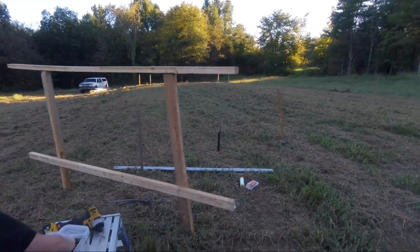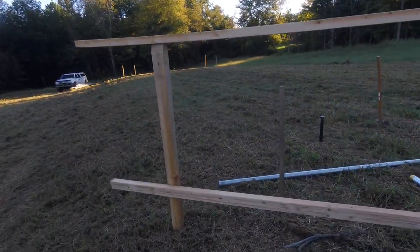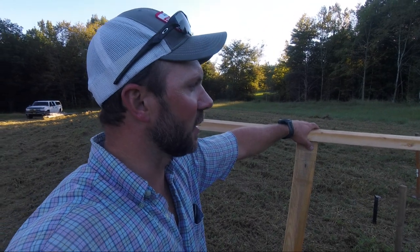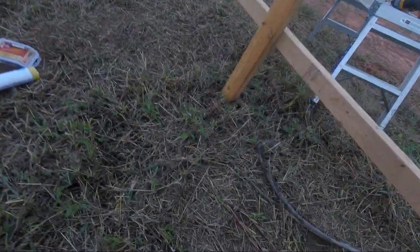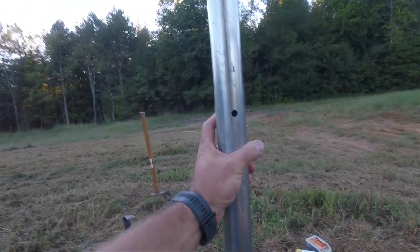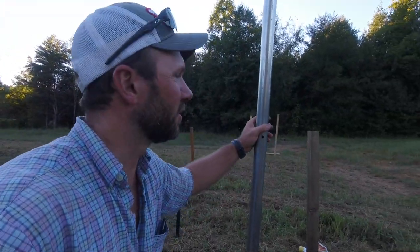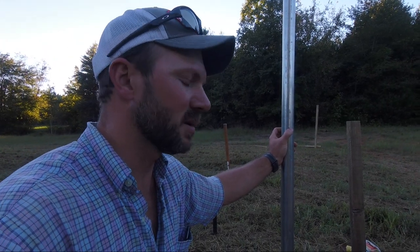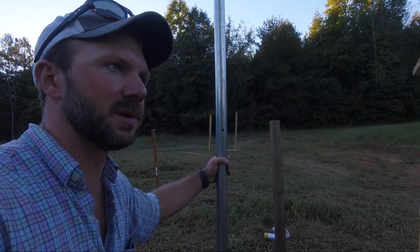This is what I was getting at with the batter boards — this is gonna be my shortest one, actually. It just worked out that way because these posts are the shortest, but I put them where I knew the post that was gonna be driven in the ground the furthest would be. That's the reason this batter board right here is on top of the post. You see these posts for the greenhouse come pre-drilled, which is pretty nice — if you've ever tried to run self-tapping screws or bore holes in this stuff, it ain't no fun and you can go through a bunch of drill bits in a hurry. This one is drilled for bolting on your baseboard at the bottom of the greenhouse, so that's how deep they intend for you to put it in the ground. I'm not sure if I'm gonna use two by eights or two by tens.